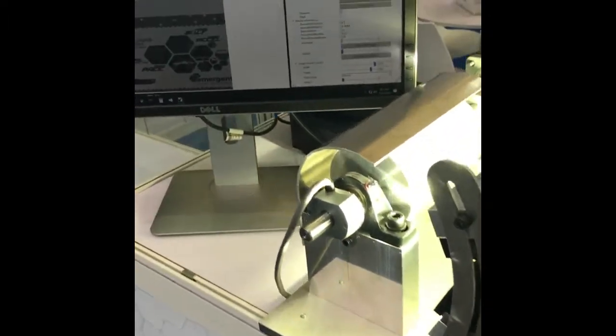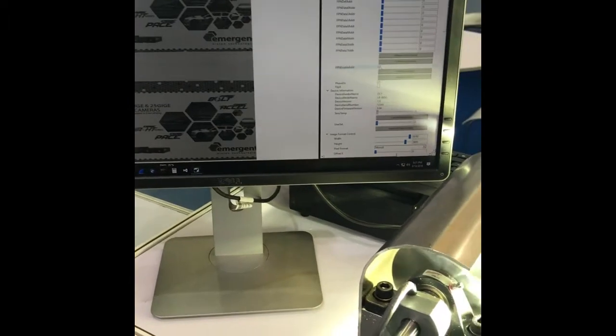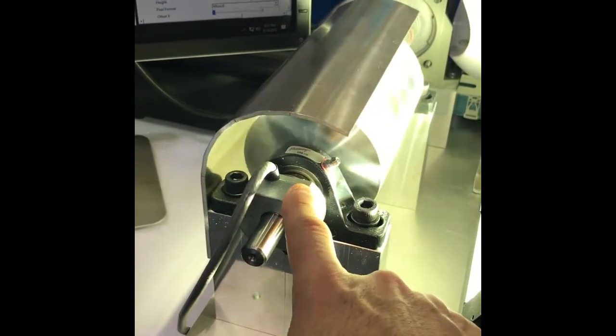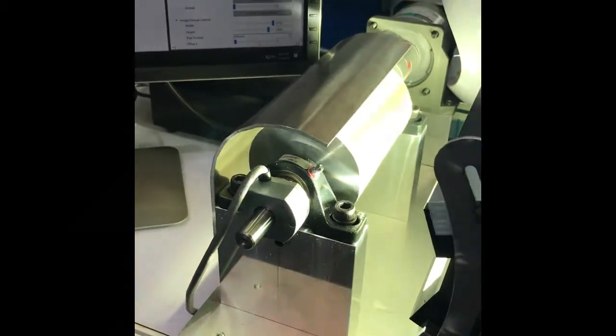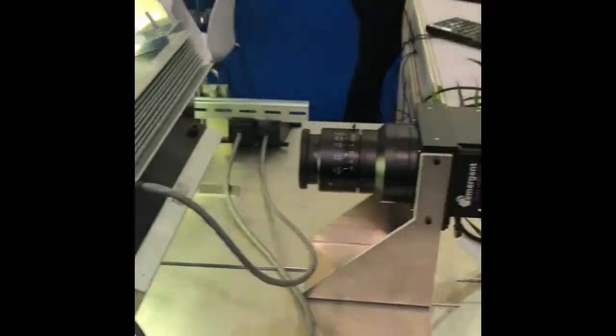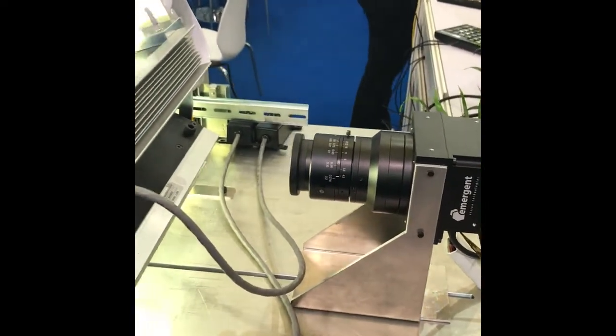We take a look at the demo system. Using our E-Capture, we've got the system set up to use hardware triggering and an encoder to receive the pulses — 6,000 pulses per rotation. The camera decodes these and takes exposures at the appropriate time.